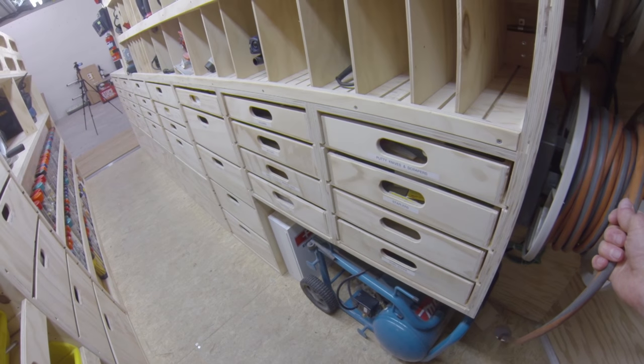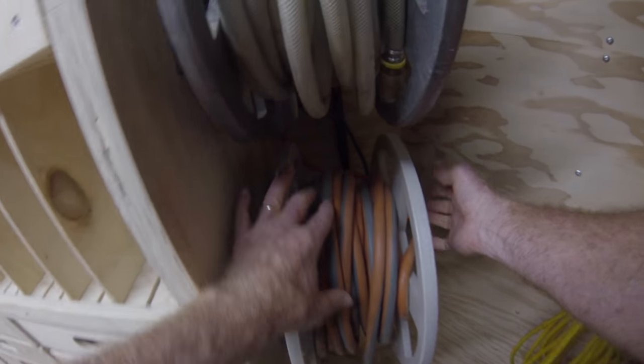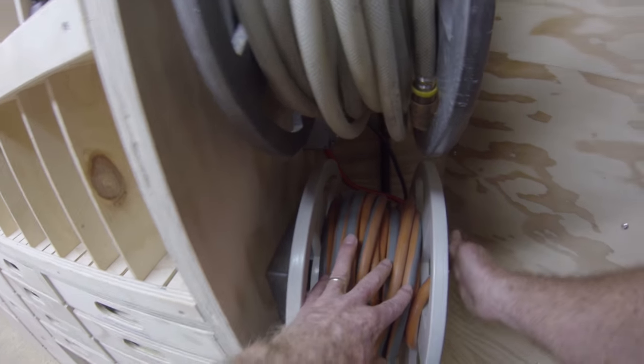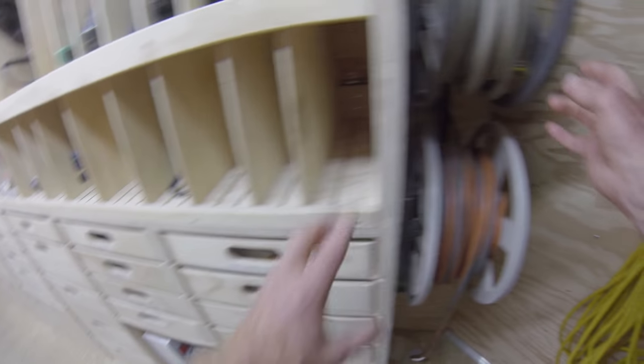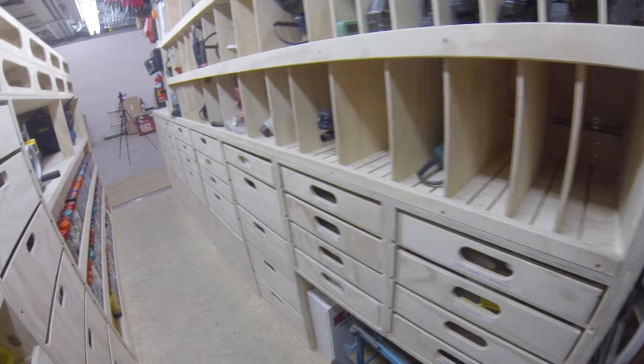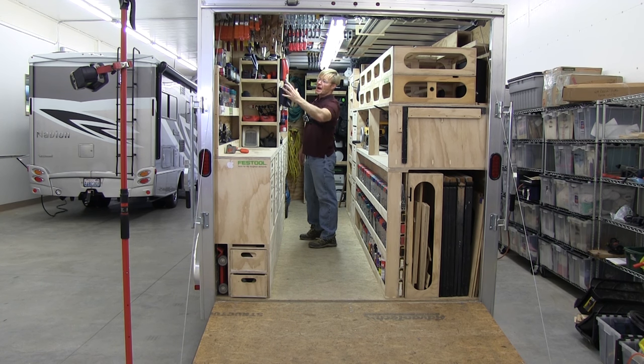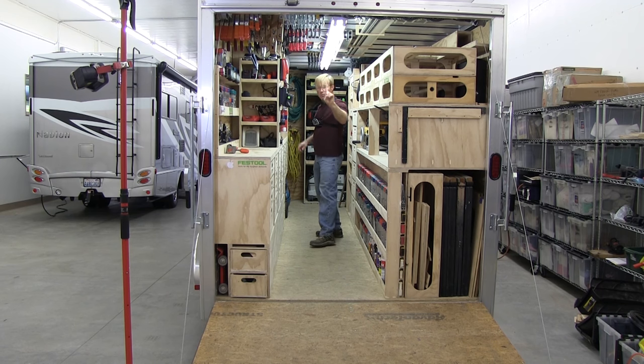The cord is a hundred footer, and I just pull it to the nearest outlet, then come back in and there's a pigtail that I plug in. It's not a super sophisticated system — just a pigtail. Once the cord is plugged in, I have power. My compressor is plugged in and ready to go. My lights are on a switch, powered from that. I have outlets powered from it, and all of my battery chargers are plugged in all the time. By plugging in that one cord, I power up the entire trailer.